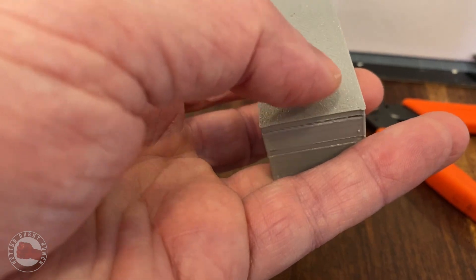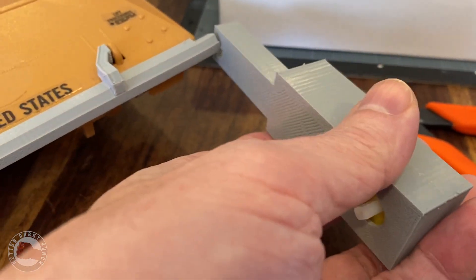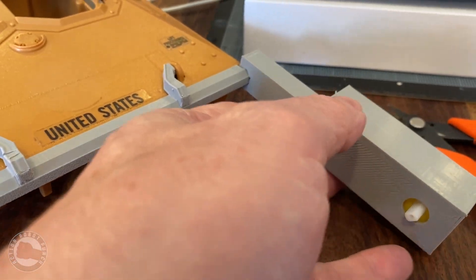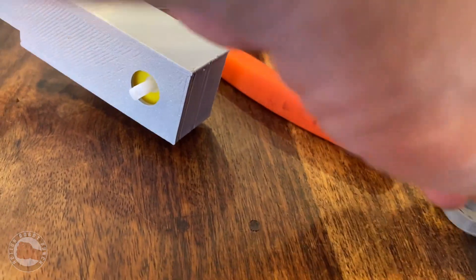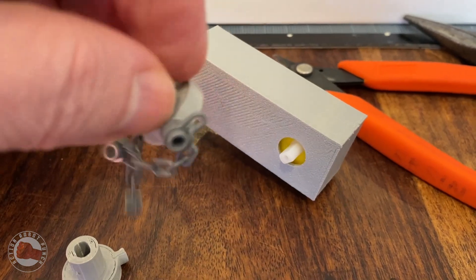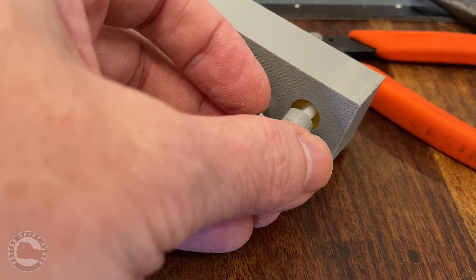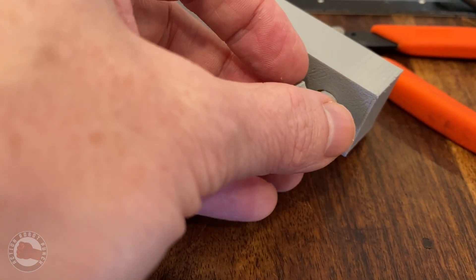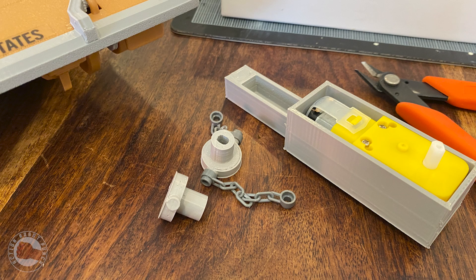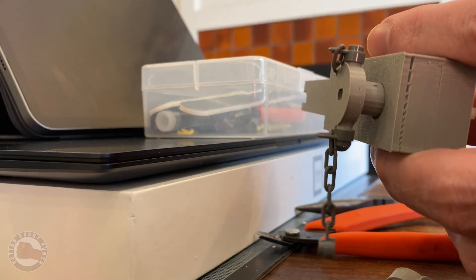Here I'm iterating with the size of the motor, thinking about how big the housing has to be and how deep to contain the entire motor unit. There's a bit of weight hanging out in the front, so I made a key system where the arm and the other arm on the other side would just slip over that main support piece. This is a mock-up of the cylinder — mostly to look at how it attaches to the motor, and how well the studs work so the chains could pop on and stay without immediately flying off.